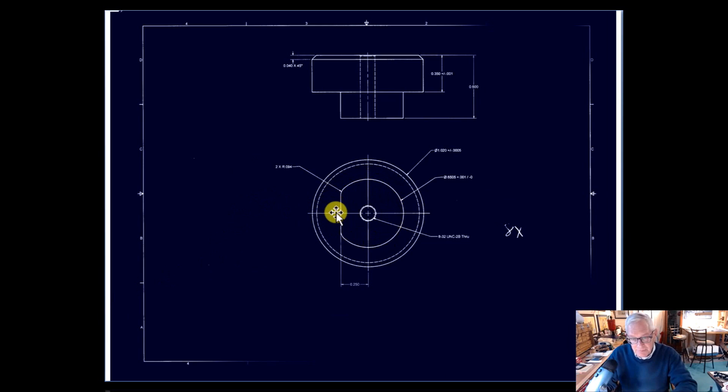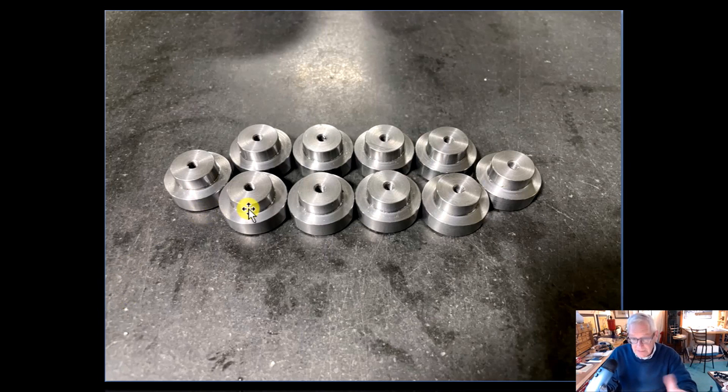They want this D-shape to press-fit into the D-shaped holes. A big thing for me is that a slip fit is a thousandth oversize hole and a press fit is a thousandth undersize hole — so I've got a thousandth to work with. If I blow this, they're going to drop in and pop right out of the fixture, or I'm going to pound it in and ruin it. The way I'm going to control that press fit is by this flat. After I machined the D-shaped holes, I measured them — they came out about a thousandth big. So on this 0.250 dimension I'm going to make it 0.252, which gives us a press fit.